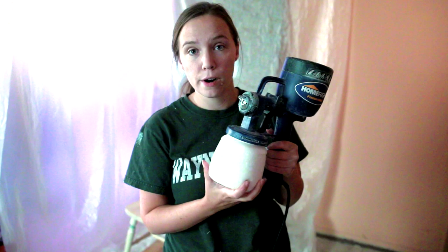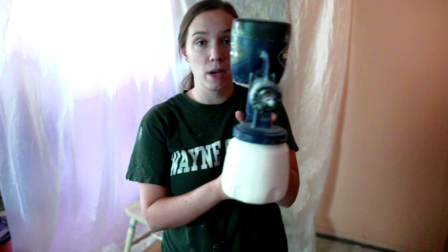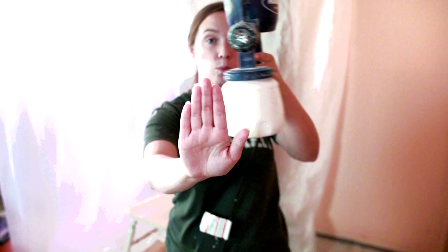If you're going to paint indoors — this is my first time, I usually do it outside but it's really windy — there was hardly any overspray, but you do want to cover the area where you're going to spray. When you're painting, you want to make sure you're painting off the piece each time so you don't get run-down paint, which can be caused by over-spraying in an area. You're going to start spraying here and continue all the way to the other side, then go up or down. There is some overspray, so I wouldn't spray near a nice fancy wall.